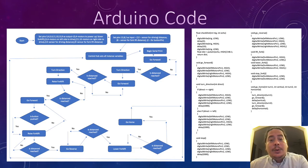Here we have the Arduino code. I just included the main functions on there, but the code was fairly extensive. Following the flowchart, from the beginning this is where we set the inputs and outputs of everything and begin the serial print. From there, we'll start going horizontally down the rail until we reach our certain location. From there, we'll turn a direction given to us by the central hub. Then we will travel vertically down between the shelf itself until we reach the location where the pallet is located, and then we will turn in that direction where it is.